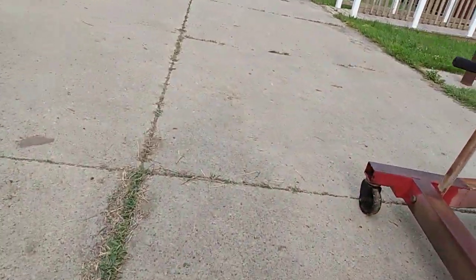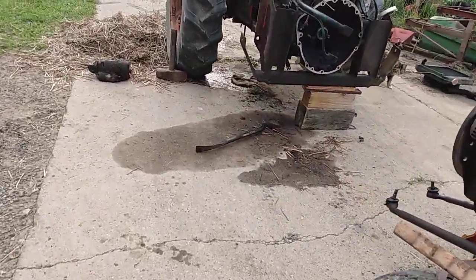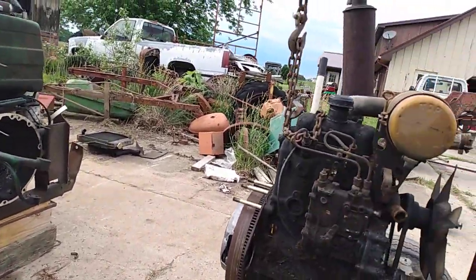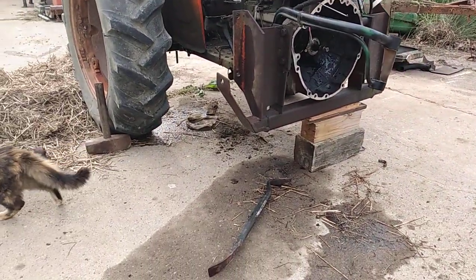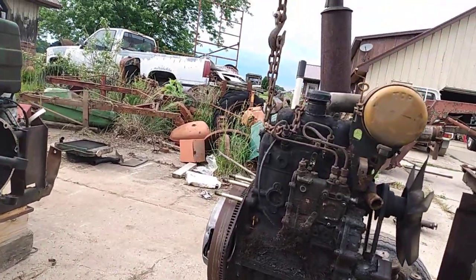We've had a pretty good day. My helper came and stripped it down and we had it ready to split when he left. I pulled it out and split it apart. This is the way that I've always done it with all my other tractors — got pictures of that — blocked the back end and pulled the front off with the engine hoist.